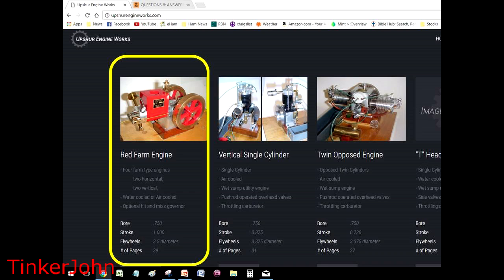And I do not have a list of materials. The material list for these engines is really going to be what you have in your scrap box. A good example would be a flywheel — you can make that flywheel out of zinc, iron, steel, aluminum, bronze, or brass, whatever you want. The cylinder sleeve can be made out of cast iron, 12L14 steel, or even pipe — I've made them out of black iron water pipe before, bored that out and used it as a cylinder liner. Or you can make the engine without a cylinder liner at all and make it one piece, though that takes a lot of work.